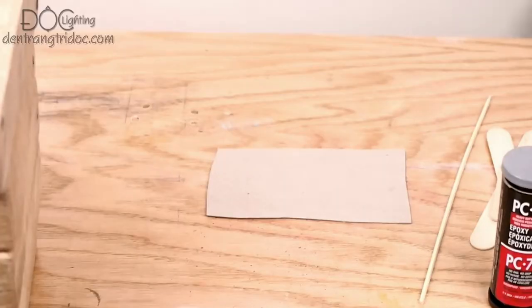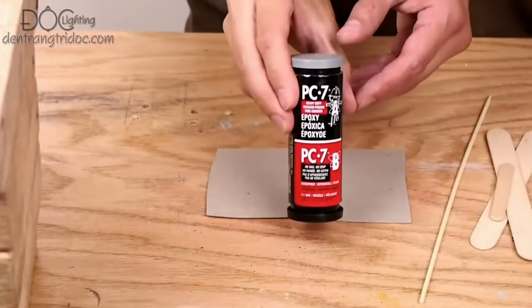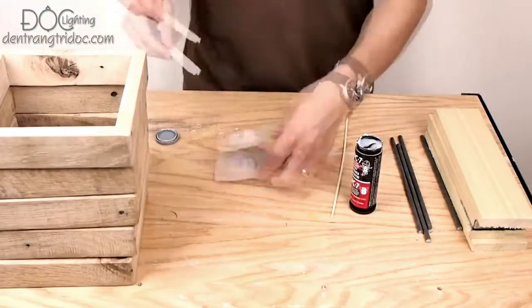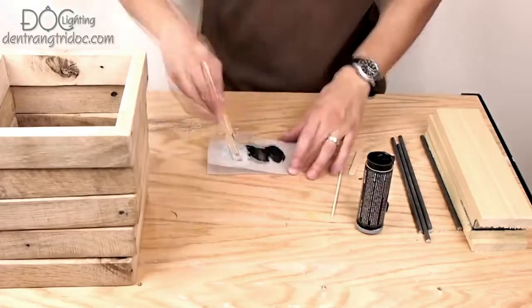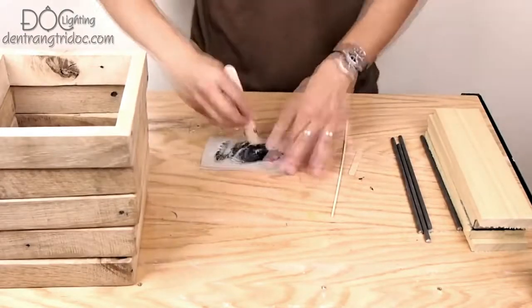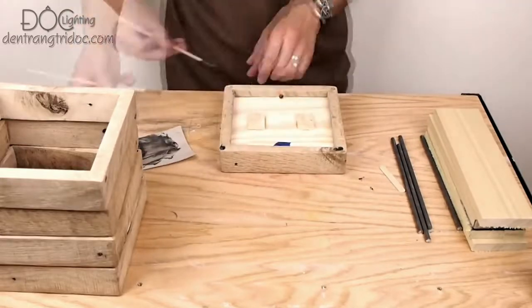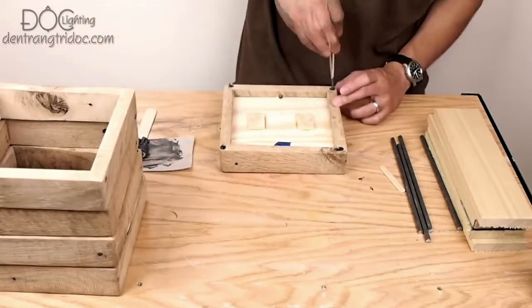To attach the wood to the steel rods, I used PC7, which is a metal reinforced paste epoxy with a long working time. Link in the description. I mixed up some PC7 and applied some to the holes in the bottom layer and put the rods into the holes.